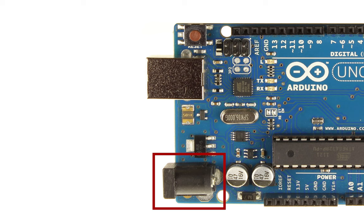Moving on to the power plugs — the black one is a 2.1mm plug that takes between 9 to 12 volts DC, and the adapter must be rated to supply more than 250 milliamps. You can also connect a battery pack via this port. The other way to power the Arduino is using the USB Type-B port, where you can plug in a USB Type-B cable to your laptop. This is also how you upload code to your Arduino Uno.